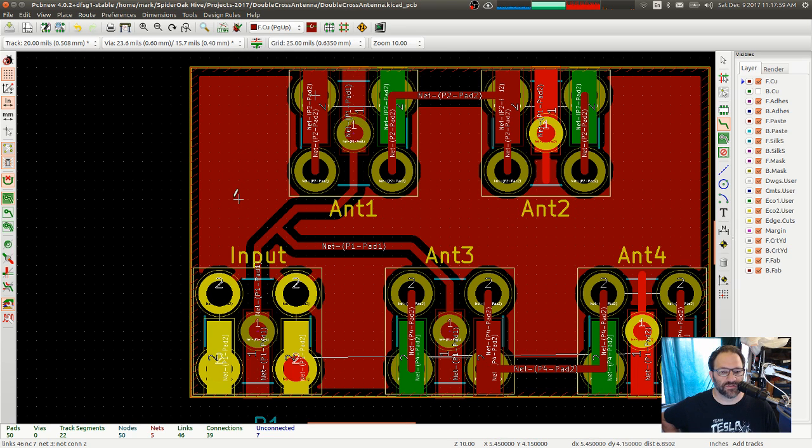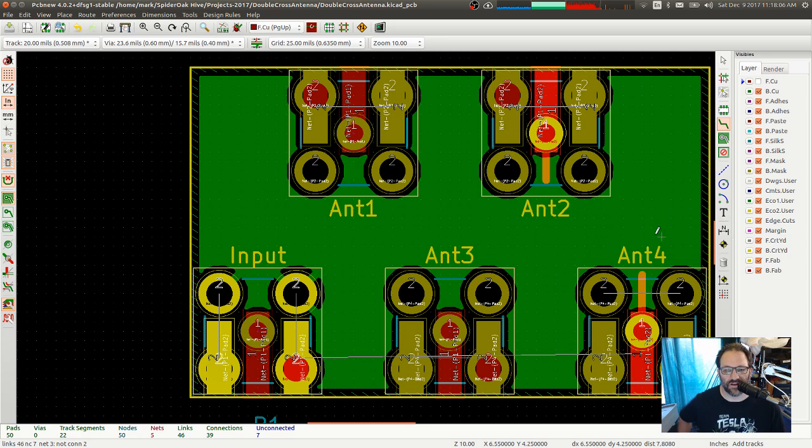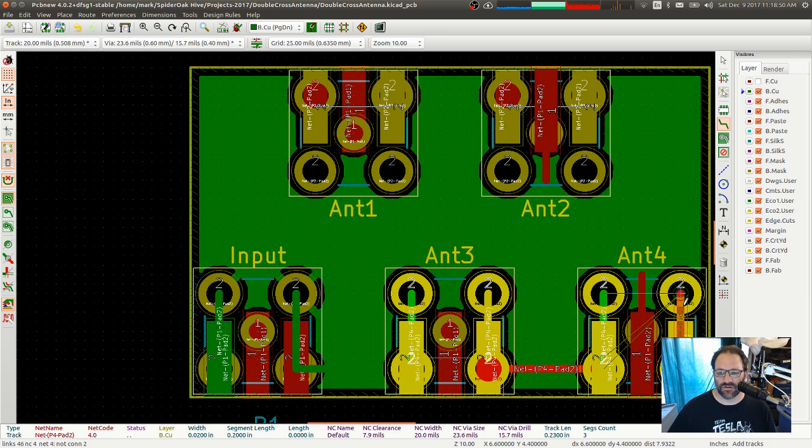So I'm going to drop some vias from here to the bottom layer, because if I do that, that's a solid one. That's how those are connecting. And so I want to via this ground plane pour to the other ones. So that's connecting the top and the bottom. Why isn't that one going in? These outlines of mine definitely have some issues, and I'm not sure what they are. Like the fact that it doesn't want to use that.